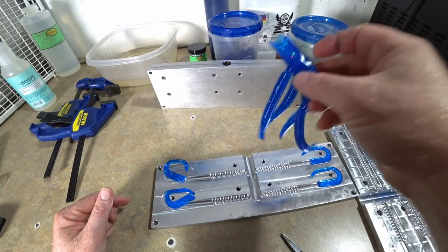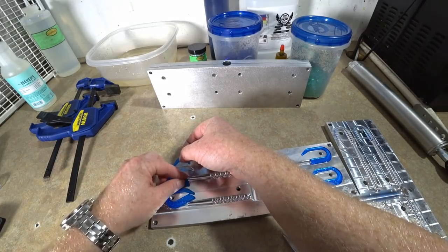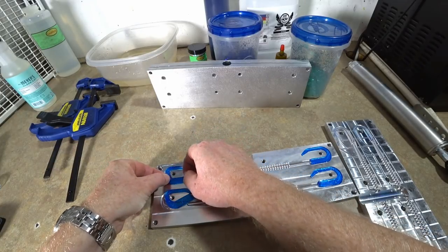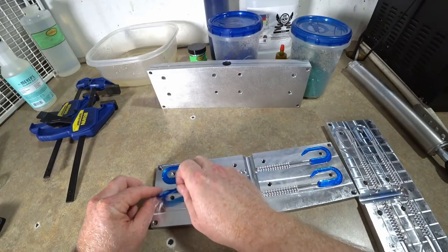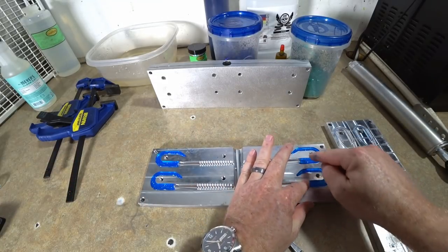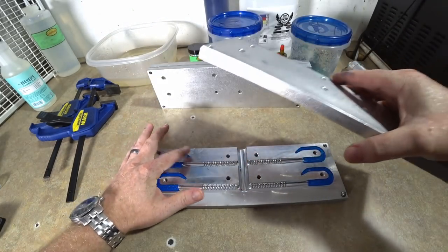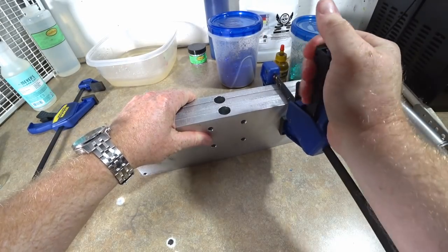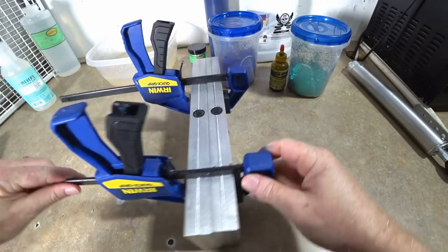You have to cut your tails off and leave them in the mold, then inject the next color very hot - that way they will fuse together and you get a pretty good bond. Something about the injection pressure of the two plastics meeting - this is completely set up now. Hand pouring, you wouldn't get a bond at all no matter how hot your plastic is, but the injection kind of forces the issue and makes them stick together.